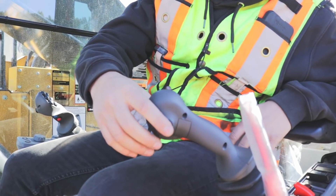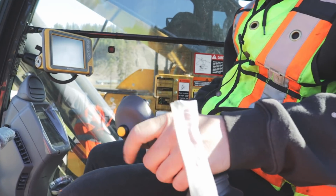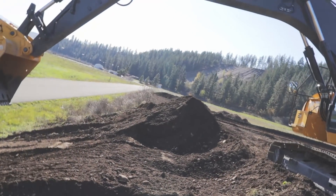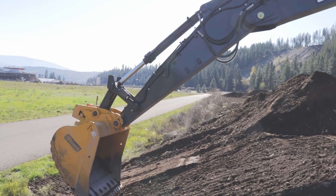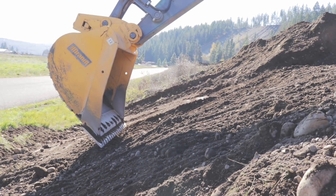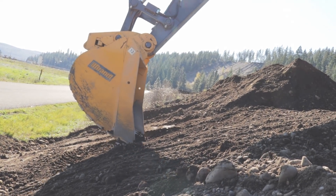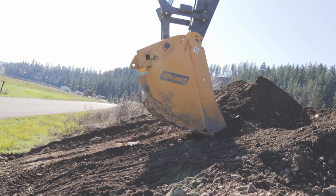There are two yellow auto buttons. You can do it two different ways: you can double-click the two buttons and automatic stays on, then press the front one to turn it off — or you can do momentary, where you just hold down on the automatic button and pull on the stick. When we start pulling on the stick, our boom and bucket are going to adjust depending on whether we have bucket control on, and follow our design. I'm going to use the momentary automatic — I need to set my offset first, I'm a little bit low. I'll hit my auto, pull back on my stick, and she's going to follow grade.